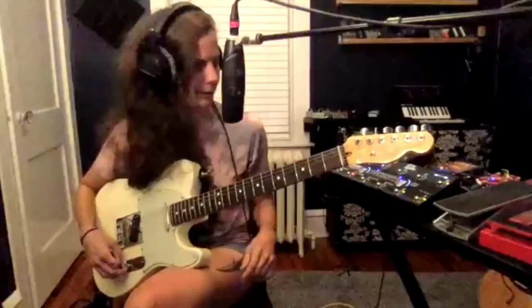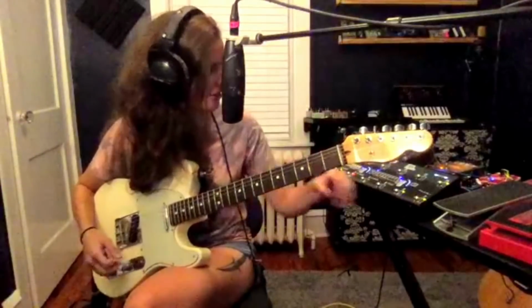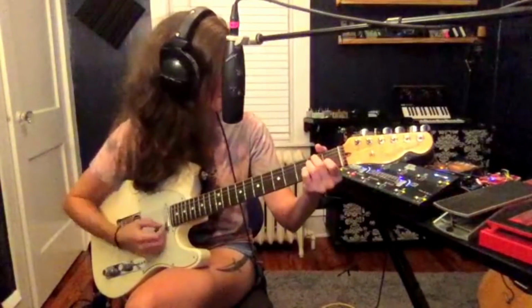So again, I don't have a master volume on my amp. What's happening is my signal's just going straight through. It comes in from the cable, hits the input, goes through the preamp tubes, and hits that EQ, which I have set with nothing extreme, just about in the middle. And then from there, it's going to hit those power tubes. So the sound that comes out is what you get. There's no master volume in between. It's the whole amp kind of wide open. Yeah, exactly. So that's kind of what we've been hearing. I have that same overdriven sound pulled up here.